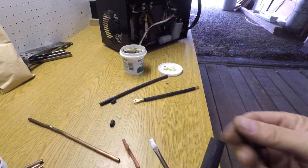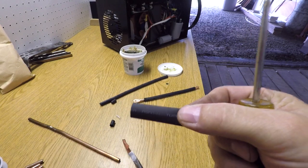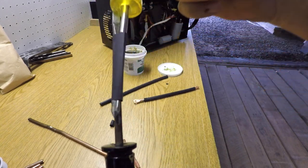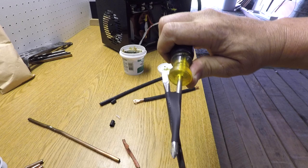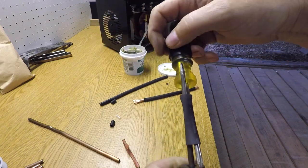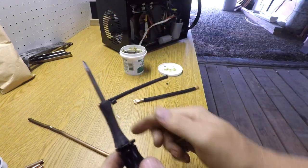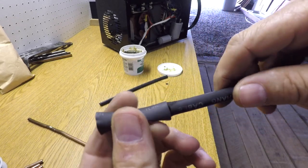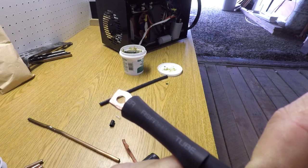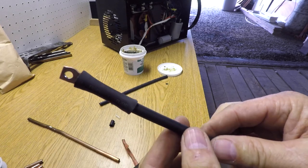Now if you're like me, I never have the right tool and I always have to improvise. My heat shrink is the biggest piece I have and it's a little bit too small. So I just take a couple of screwdrivers, put them down in the heat shrink like this, and then twist it just to stretch it a little bit. It won't be stretched in the center as much as it is on the ends, but that will be good enough to get it on the cable. I'll work it down to where I want it to be and then shrink it.